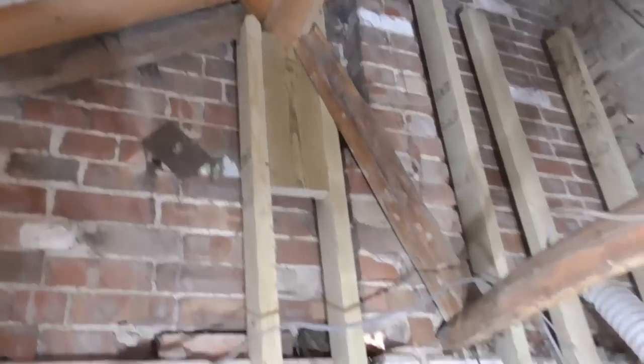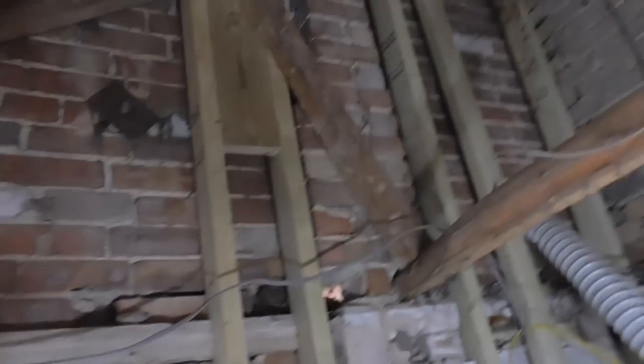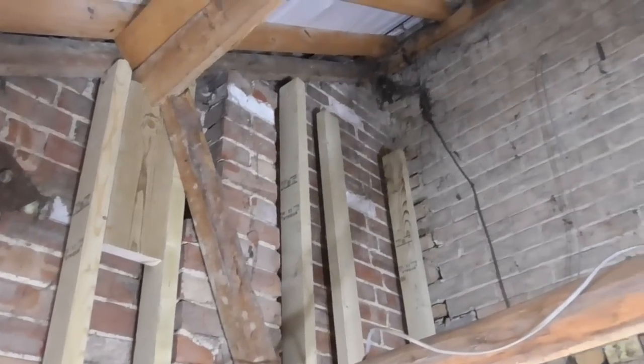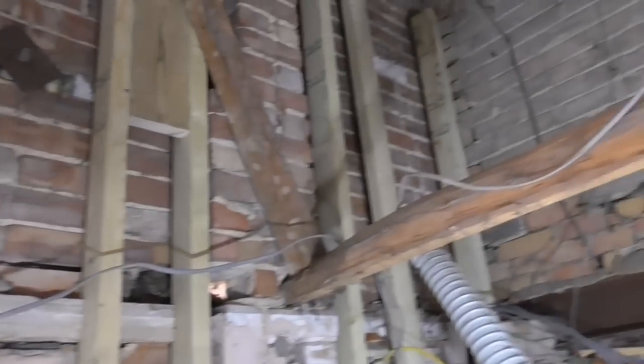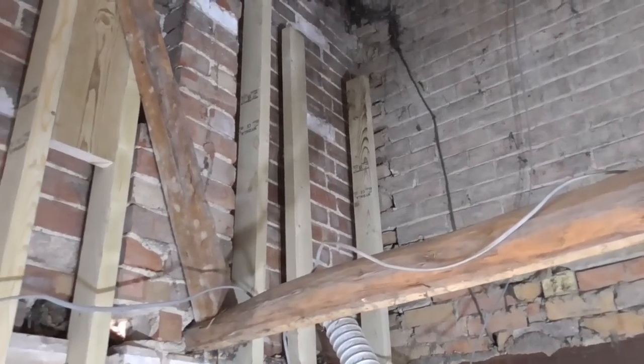And then we're sort of starting to get on top of it a little bit, put a head through this window, put a sill plate through, or whatever you call that, a plate through at windowsill level, start to fill that out with studs, start to look like we've actually done something. It's been a long old morning to get these, 1, 2, 3, 4 studs fitted, so yeah. Slow progress, but it is, as I said, kind of par for the course on jobs like this.